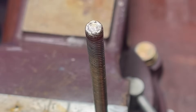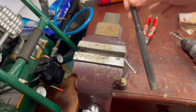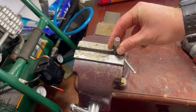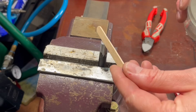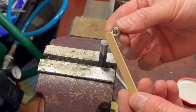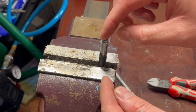Let's try something more substantial now. This is a hardened steel punch - I've sanded off the sides and the top and we'll see if we can braze this little nut on top and see if it works. First, a small amount of silver flux applied to the punch - probably a bit too much - and a little bit on the nut as well. Then the brazing rod is placed on top with the flux, hopefully keeping some of that in place.